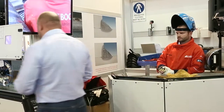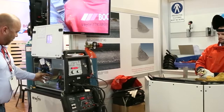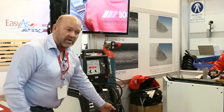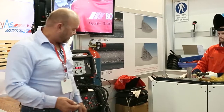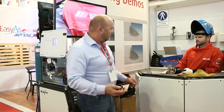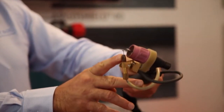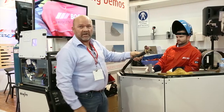We can adjust the wire. Once it comes through your feed, up to your gun — a water-cooled gun is on the unit because we've got continuous amperage, which keeps it cool. So your wire feed will come up the gun, in through the wire tube, into the arc, as a continuous feed.